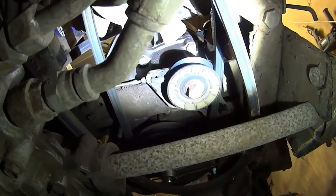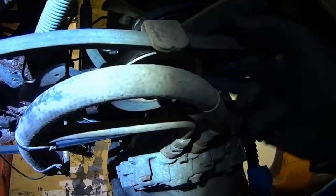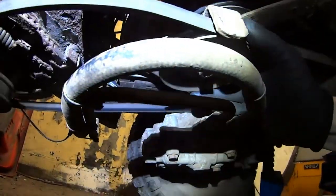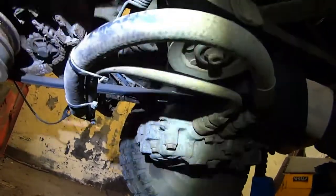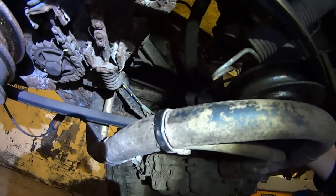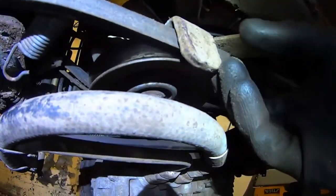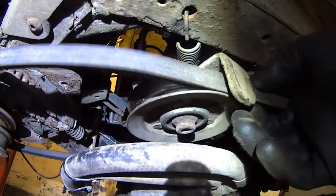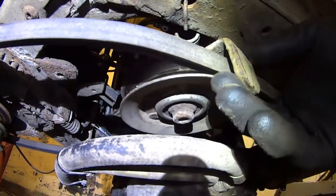Actually the best way is to loosen all the belts so they're like floppy, and just get a good feel on them. The belts are loose now. I unhooked the spring — I don't remember where it goes. Oh, there's an eye back there. It's pretty hard to remove these springs, but once you do, these pulleys are free spinning. Make sure the belt does not touch, make sure the pulley doesn't touch anything, and then rotate the pulley and listen for noises and feel the texture.